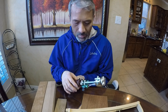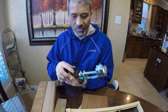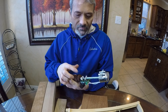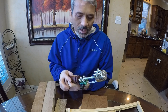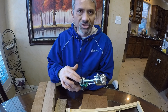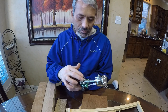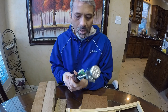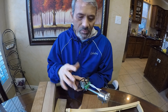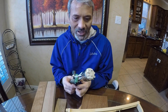I wanted to talk about a couple of other things. When you put this thing together, use some sort of spacer when you mount this device on top of the bar so you don't get a shock or anything — it also shields from the heat. This rod is going to get hot, so this PCB doesn't get hot. We're going to eventually cover this with some sort of cover, but right now everything is live, so don't touch it while you're using it.